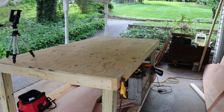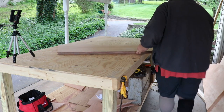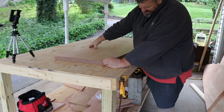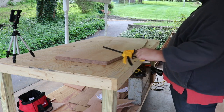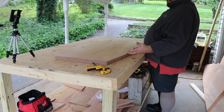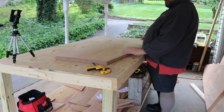And now we're going to work on the transom. Get these centered up. I got three blanks here essentially. I've rough cut them out. I've lined them up. I've got some hash marks on them to keep them aligned. I'm going to clamp them together, put some final measurements on it, and then we're going to do a rough second cut, I would say, to get them down to maybe an inch, or where we think it belongs, because they're wide now. And then glue them together, and then do our final cut after that.